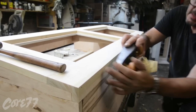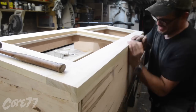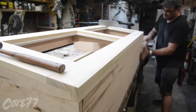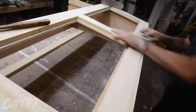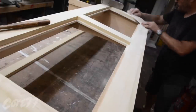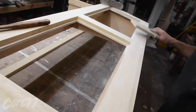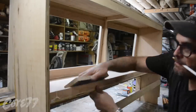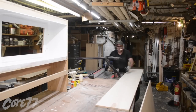I'm pulling apart my piece to make sure it's not glued together and I have to start processing each piece on its own. I get some nice fine finishing on there — with that miter plane I'm able to pull off a 1.5 inch wide strip. Sanding with my longboard — the longboard is one of the most important things whenever you do anything like this, getting those joints all nice and smooth, working them into one another. The longboard is just an old school sanding board with 80 grit, sometimes 100 grit. There's some interior storage in that little area there which you'll see in a minute.